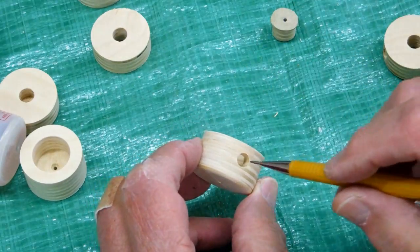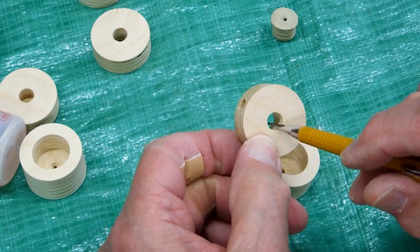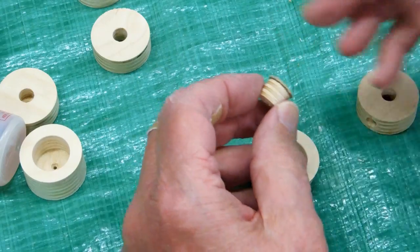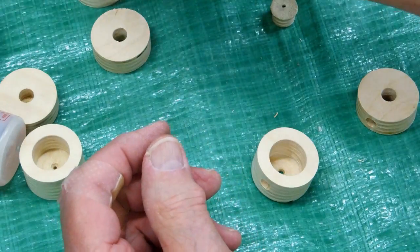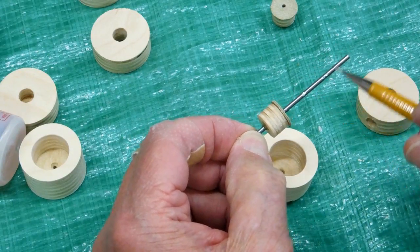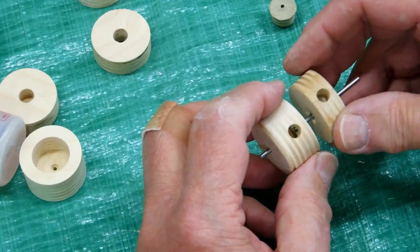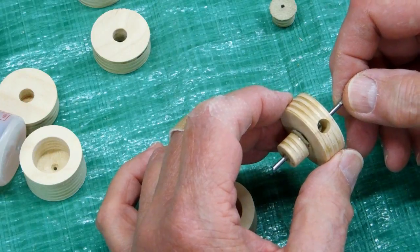A few of these pieces have been modified — I drilled an air hole into this chamber. This piece has been drilled all the way through 5/16ths with an air hole drilled into that chamber. These plugs have been shortened to about 3/8ths of an inch and covered with leather. I've used 3/32nds piano wire and ground a few notches in it for the epoxy to latch onto. This part goes in here and comes through here, so it becomes a poppet valve that works against that face.